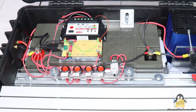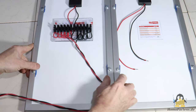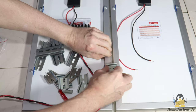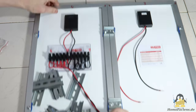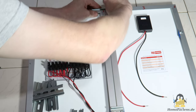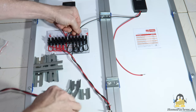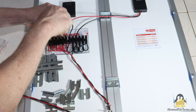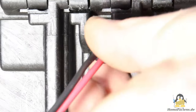The solar panels also find their place in the suitcase — I use 6 of them. For operation, the panels are joined by screws and pieces of a cable rail, and stabilized with additional pieces that are clamped to the top of the frame. The solar panels are connected in parallel via screw terminals on the backside of one of them. From there, two cables run to a socket on the back of the case.